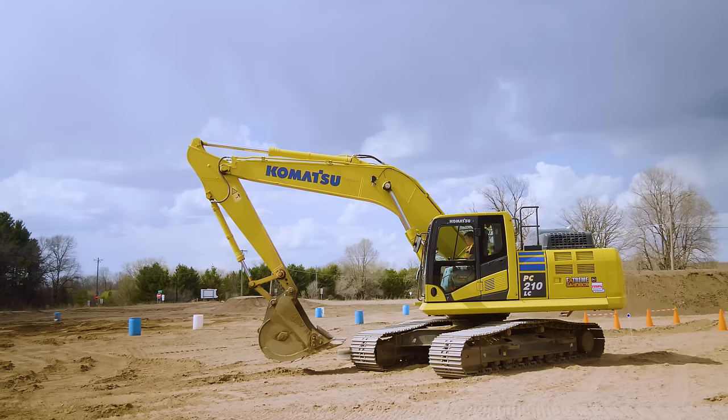There are some people who talk about a different orientation, depending if they were logging. I've seen some guys comment this, which I wouldn't have thought about, but it makes sense. If for some reason an obstruction did come through that window, you'll notice it would actually push these things back. So that's the other reason I have the drive motors there, because it would push you away, versus if something came through that window and pushed on it, you'd be pushed into it. Again, it's funny. Some of those things I don't think of, but other guys have seen that.